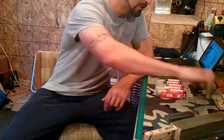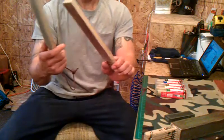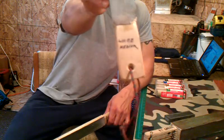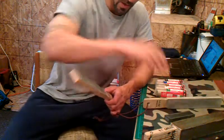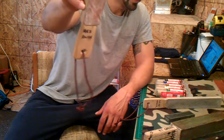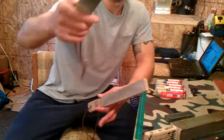I have my personal strops — these beater ones, one of the very first ones I made. I have two double-sided strops. The first has black on one side, which is coarse, and white compound on the other, which is medium coarse. The other strop has fine green on one side, and red on the other, which is like a polish with no abrasives — the final touch. Usually I go from white to green to red just to maintain my blades.